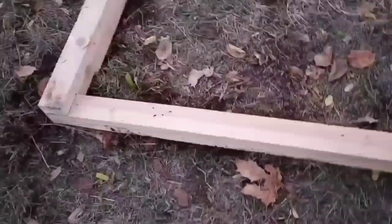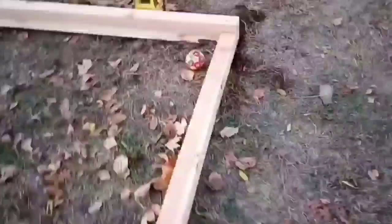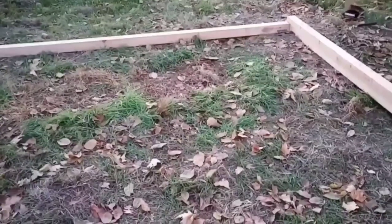First tip: if you're trying to figure out how to flip a 12-foot frame over, you need to push it up on one side, you need to have another partner, and grab midway through the 12-foot pieces. Tilt it over, then back in like that. Now's the time to make sure it's square.